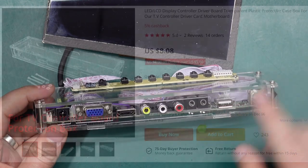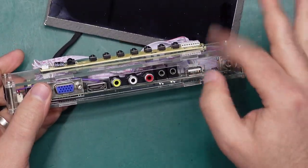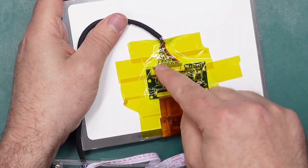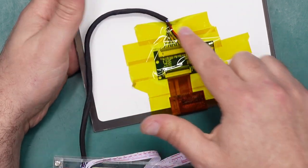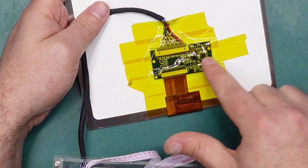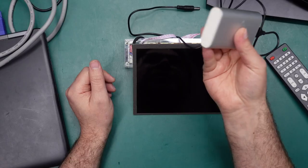The other thing you'll want is the Perspex case, which is generally sold separately from the driver board — it's just a clear acrylic case. Then finally the LCD panel itself — the cable runs into a separate PCB and then to the flat flex connector. I'll link the cable and PCB in the description. The only other thing you'll need is your own power supply — it draws about 400 milliamps off a DC supply with this particular screen, or about 1 amp at 5 volts.